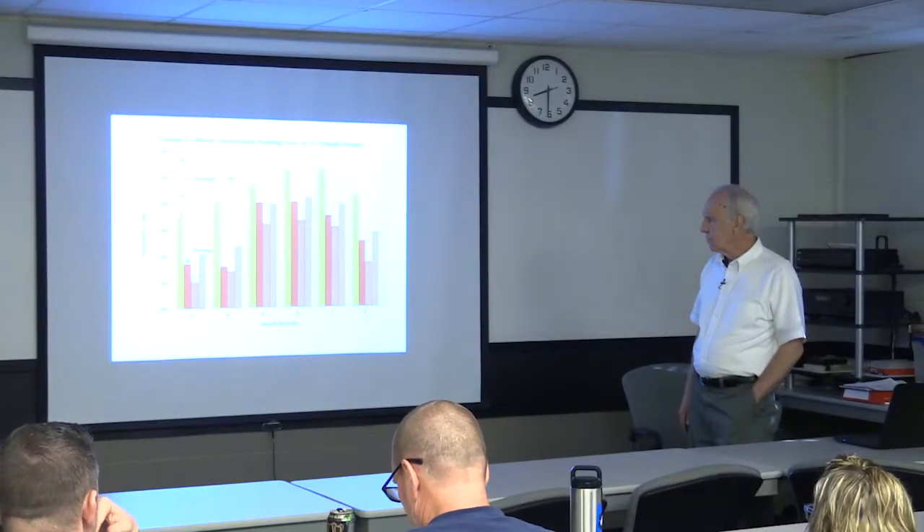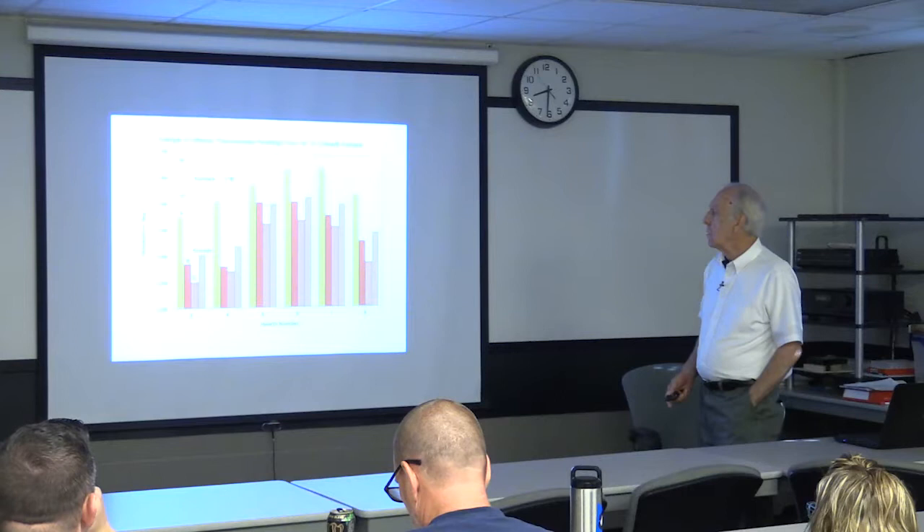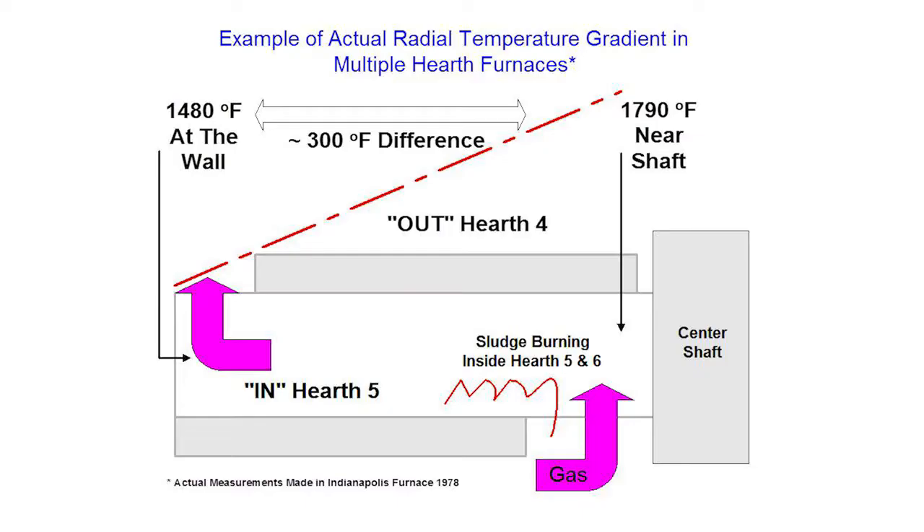Since we look at temperatures a lot, here's an example from Hartford, Connecticut, where there's a 250-degree difference even among thermocouples around the circumference depending on what's going on. Back to this issue I've been raising about being regulated to a minimum combustion zone temperature — the rule doesn't respect the fact that these thermocouples are only measuring a surrogate temperature at the wall; it can be a lot hotter inside.